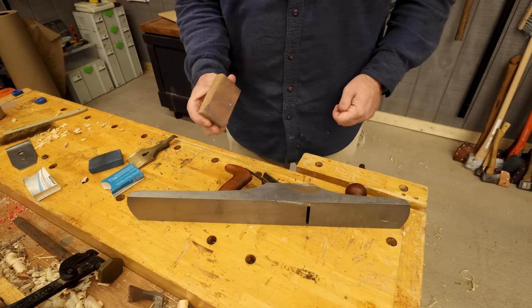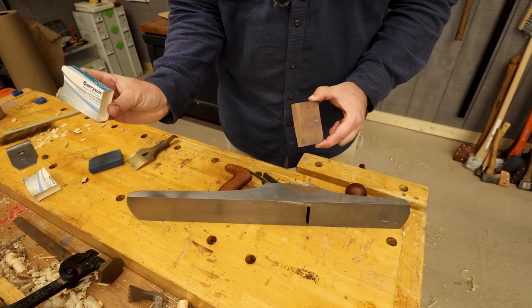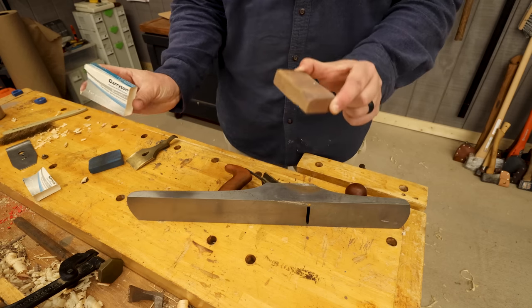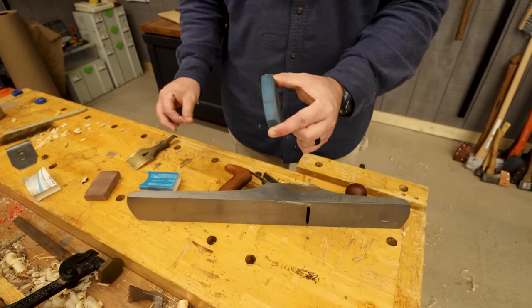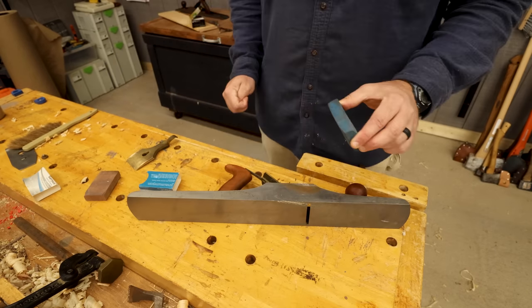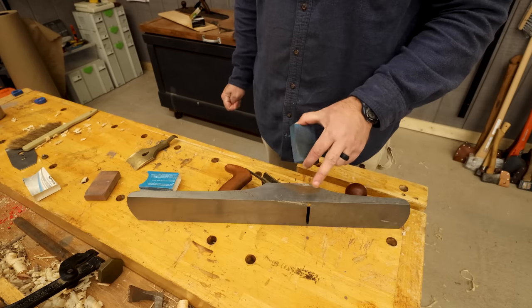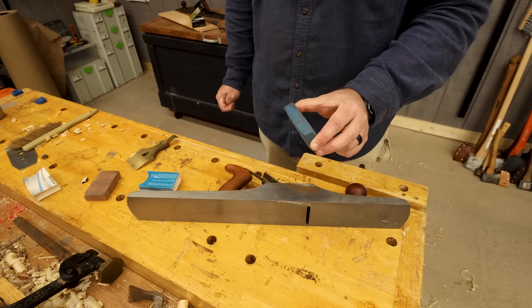Like I said, this is the brown, and it's considered, so I'm telling you guys, I had it backwards actually. The brown is the fine, the blue is the coarse. Had it totally backwards. That's a shocker. A YouTuber made a mistake. My goodness. But it doesn't take much pressure at all, and you can get rid of all this stuff as long as there's no pitting in the steel. As long as it's just surface rust, it comes right off.